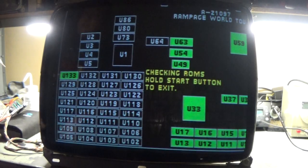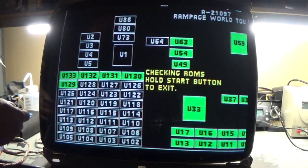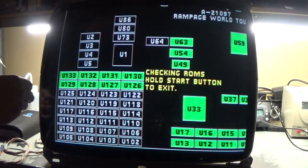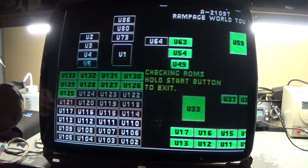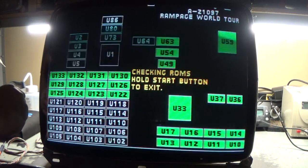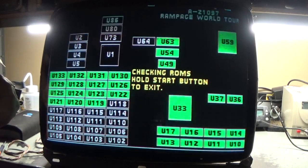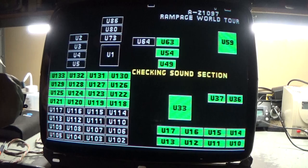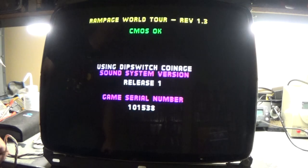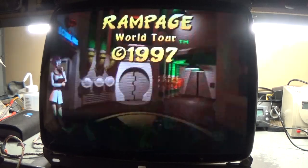Well, as expected, because the test pattern generator is such a different resolution and higher output, we'll need to adjust this here. Okay, H phase is position. And that looks pretty good right there. Vertical amp is height. Okay. Looking pretty darn good so far. Of course, we need to do some degaussing, but